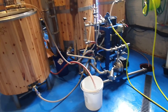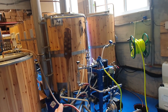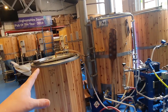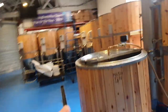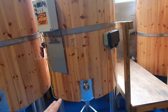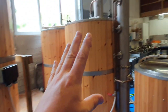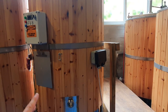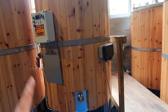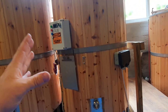I do hope you can hear me. This is going to be a long video, so grab a beer and fill your boots, but I'll try and keep it as short as possible. This is the busiest part of the day, actually — everything hot side and before hot side. When we get to the cold side, while we're transferring and boiling, I'll fill this tank up with caustic, give it a caustic, rinse it in a very similar fashion to how we rinsed that tank, then put some acid in to recirculate it and drain that all out. Then that's ready for the beer to just be pumped into.